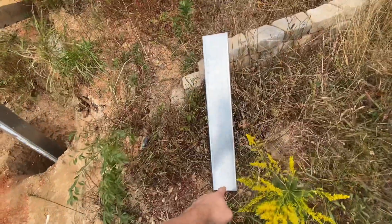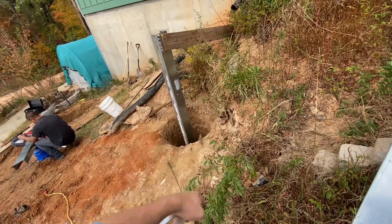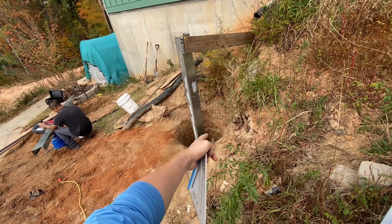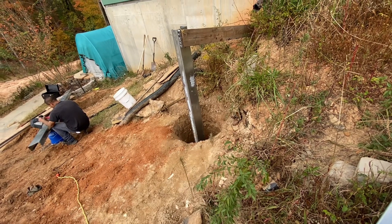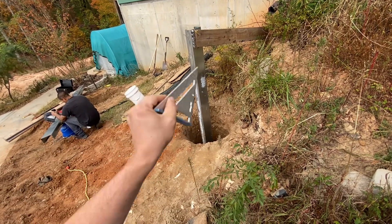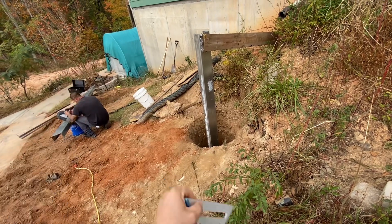Make sure you cut the bottom piece off — the top piece has lots of holes in it, the bottom piece doesn't. Another little thing to always remember: if you face the flat part of the post towards the east, you get the even degree tilts for the array — 10, 20, 30 degrees. If you face the flat face west, you get the odd tilts.